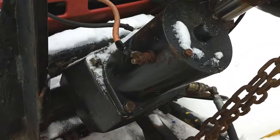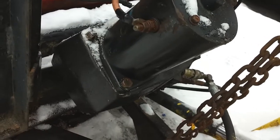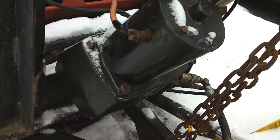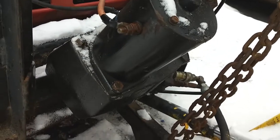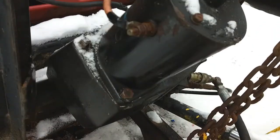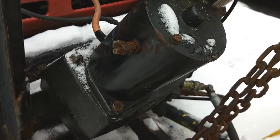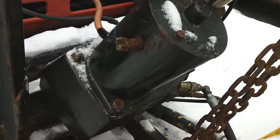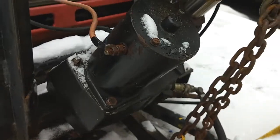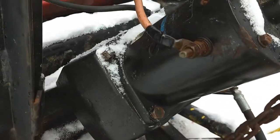So I was watching this one guy on YouTube, and he was showing something on his Fisher pump, and it doesn't seem too bad to do. There's a little filter in there, and it gets clogged up with all kinds of crap, and sometimes ice, if you have some older fluid, you know, that has moisture in it. To get to it, you got to take this motor off.